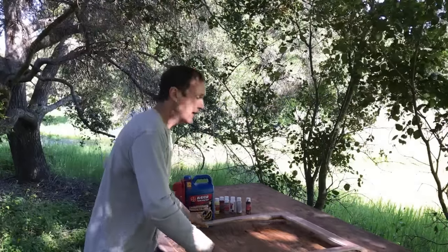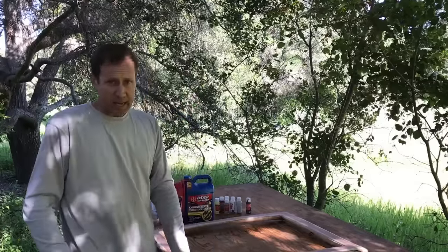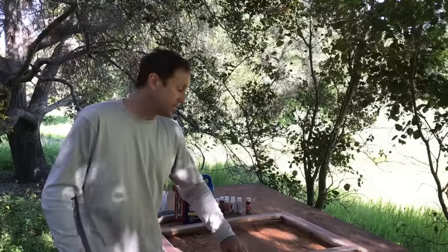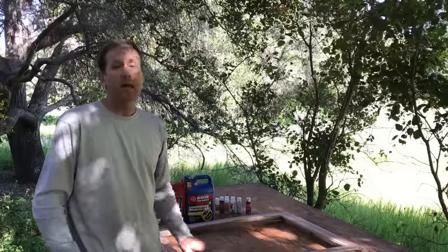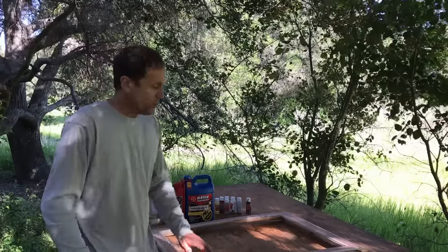After the paint's dry, I give it a light sand. The main reason I do that is so that I can dull down the paint finish to a really flat finish. I also burn through the paint in some places so that you can see some of the lighter highlights, but I definitely don't go overboard with the sanding. It's just real fast, real light, and then it's done.